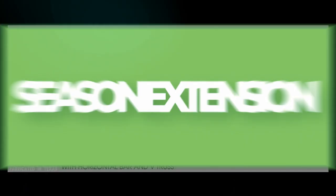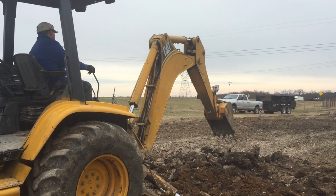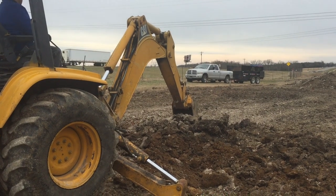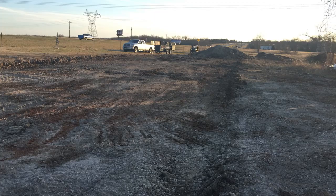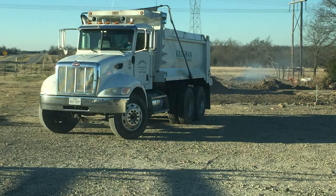We're back and we're going to talk about site prep for a hoop house. The number one thing is going to be the location. Depending on how much room you have to work with, that may severely limit the size of your hoop house. There are things like shade, trees, utility lines, how close it is to the building, snow drift, and how far away from structures, the road, and easements that you may need to consider.